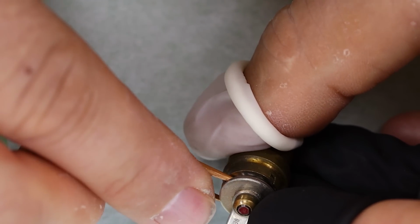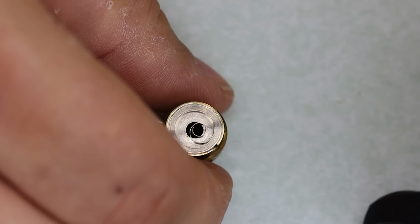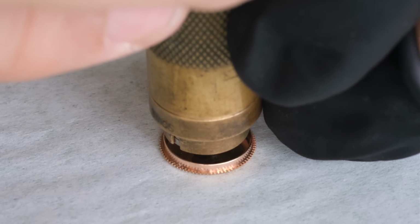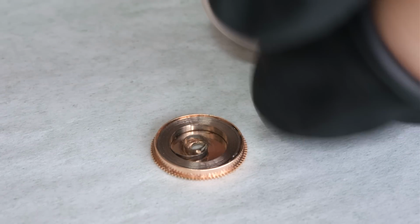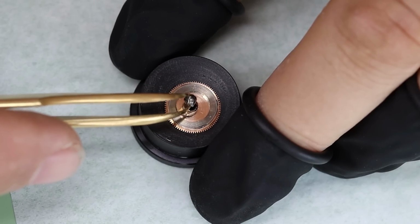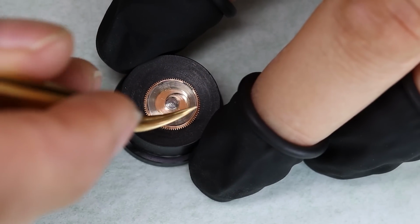So to get the right mix, we put some grease on the sides of the barrel. And then we use this mainspring winder to be able to coil the mainspring up inside it. And then we can press that into the barrel. And there we go. And yes, I said it before, watchmakers are tool junkies, but some tools are quite indispensable. Mainspring winder is one of them. And with the mainspring in the barrel, we can put in the barrel arbor, put the lid back on, and then we're going to press fit it.